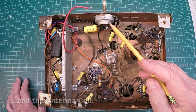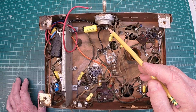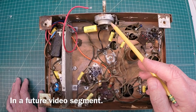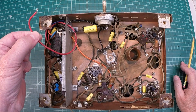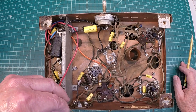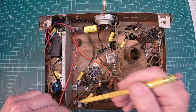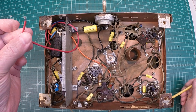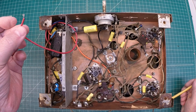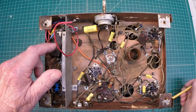I'm a little suspect with the on/off and volume control, and I'll expand more on that in just a bit. This is my B+ lead, and you'll see I'm going to have it jumpered in when I bring this thing up — it attaches right here, so for now I've got it loose. This should be my 147 volts coming from the power supply itself.